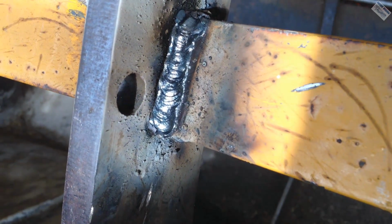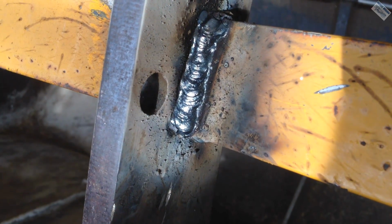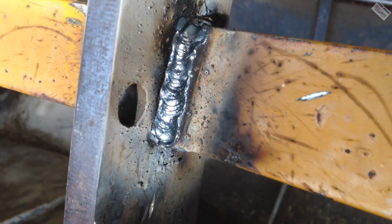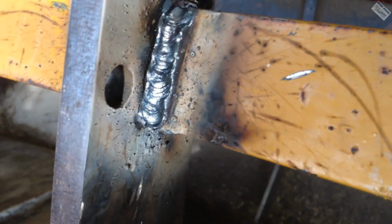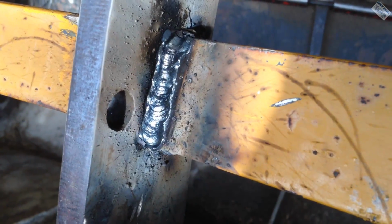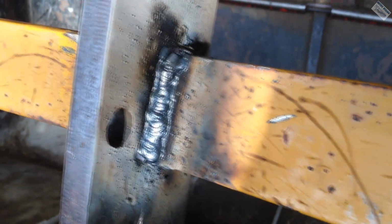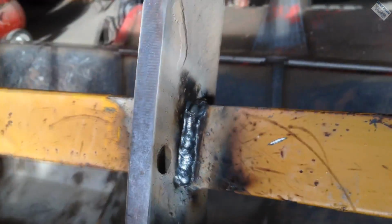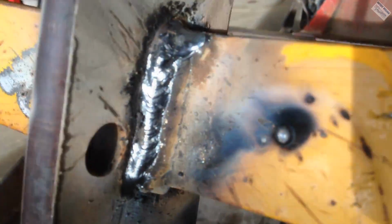I think those welds look 100 times better. Okay, maybe not 100. That's the thing with 7014. It'll get droopy on you when you weld vertically. Oh, well, 114, isn't it? Whatever. This rod welds exactly like a 7014. So, let's see here. Which one? This one, too. We'll show you.